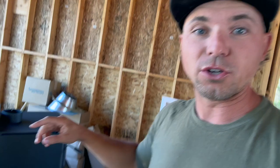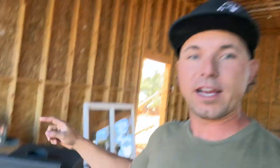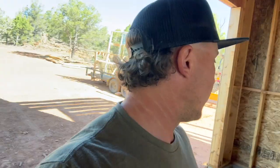I uncovered the stove to look at the instructions and check clearance distances from the wall, because I need to put the support box up in the roof today — our roofing is arriving hopefully in the next couple of days. The exhaust that comes out of the roof needs to be fully installed so we can cut a hole for it when we do the roofing. I need to figure out exactly how far from the wall and from the door it needs to be, then I can use my plumb bob to mark exactly where to cut out at the top.